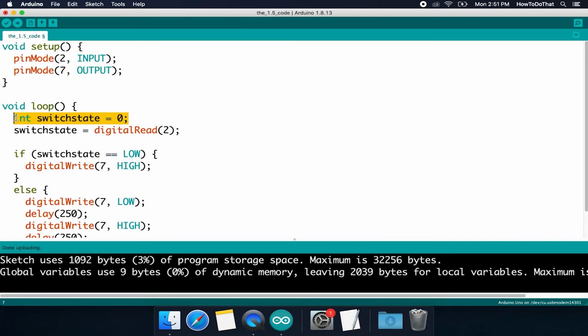And right now, you're not going to notice any issues, but what if this is a board that's meant to run for weeks and weeks without restart? You want to have as efficient memory use as possible. So right now, this variable is what's called a local variable because it only exists locally, because it is defined within this function.